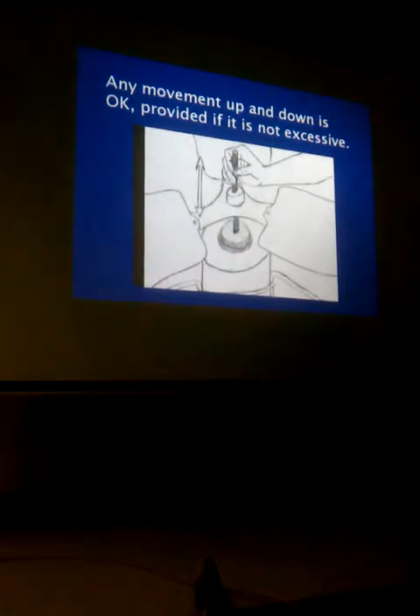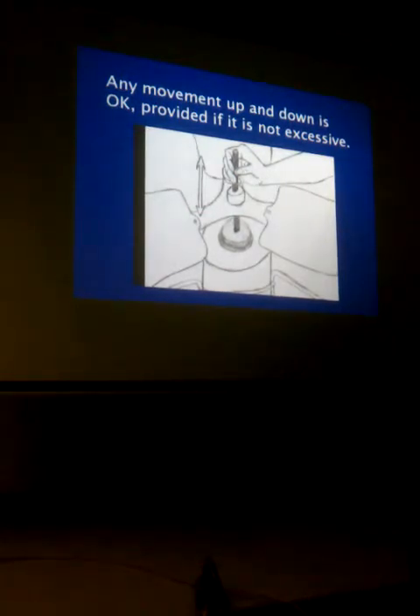We also have the ability to use a non-contact infrared thermometer. Mainly we check disconnects and fuse connections, but you can shoot a bearing with it too. If you're doing it consistently, you'll know what normal bearing temperature is. In large facilities they used to have people walking around with a clipboard measuring and recording bearing temperatures. If the same person is always five degrees warmer than another, it might just be because they're shorter and closer to the bearing — infrared non-contact thermometers get less accurate the farther away you are. But if a bearing suddenly reads 25 degrees higher than normal, there's a problem.